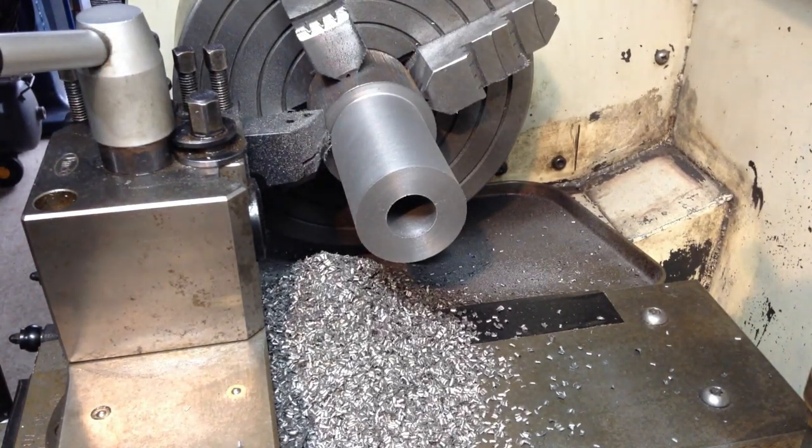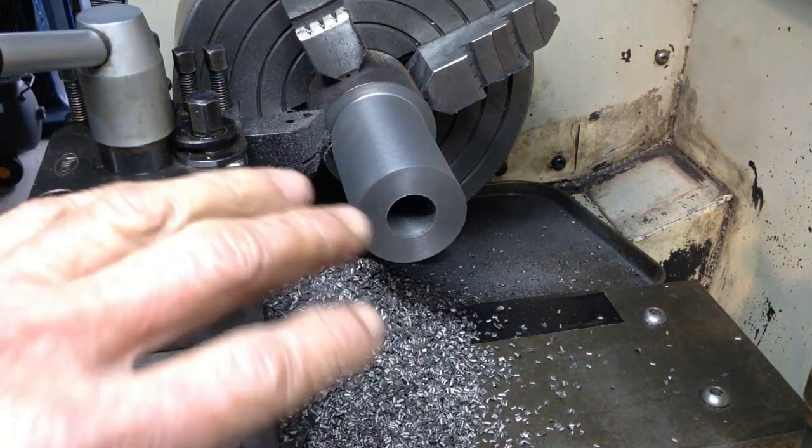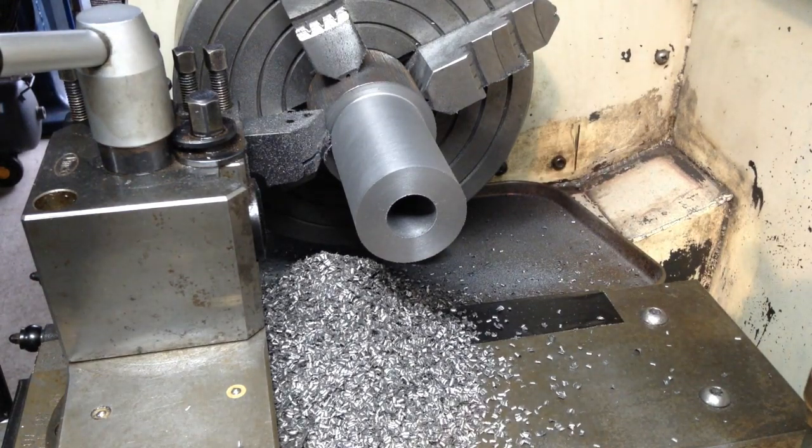That's just a moderate speed, that 300 rpm and a slow feed rate, so it stops all the rubbish flying out everywhere. Everything's kept contained. So it may take a tad longer time-wise turning it, but what I lose here I save on the cleanup. So we'll get set up now and we'll get it swapped over.